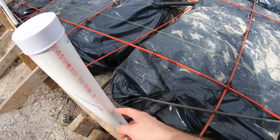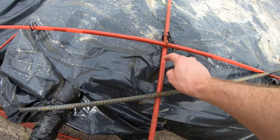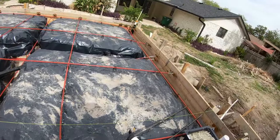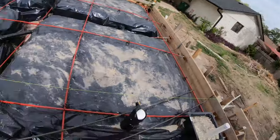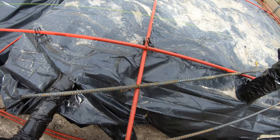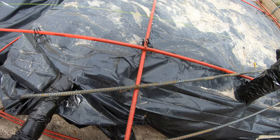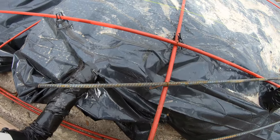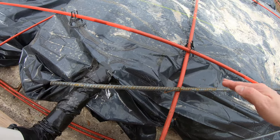One thing I noticed was I was over here looking at the cable system and you'll see right here, there's a pipe going here and a pipe going right here, and this cable is literally resting right on top of that pipe. When they pour the foundation they come back and tighten these cables to kind of tighten up the slab. That looks like a recipe for disaster because they'd start tightening this cable down and it's going to crack this pipe and cause an issue. So I mentioned it to the foundation crew and they're going to make slight adjustments to make sure it's got plenty of clearance — the only other alternative is to go below the pipe, but I think they're going to raise it a little bit.